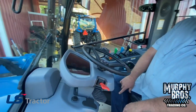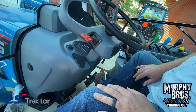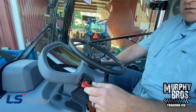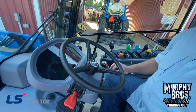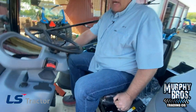As we move to the floor, you do have your brakes, and they are separable. You can move a lever here and use just your left or just your right for cutting brakes, just like most other tractors. Transmission — we talked about the shuttle lever: forward, neutral, and reverse. You've got three ranges: low, medium, and high, and you've got four speeds in each one of those ranges. Your shuttle and your speed are fully synchronized. Your range is your left hand — just like on most tractors, before you shift the range, you're going to mash the clutch and come to a stop. You do not shift the range on the fly. Come to a stop, then shift from low to medium or medium to high, or whatever. Do not shift your range while you're moving.